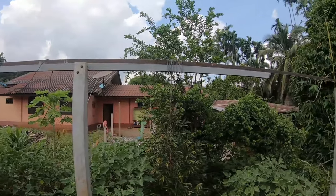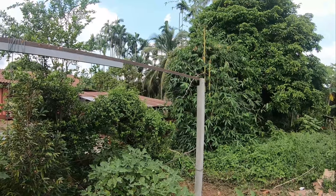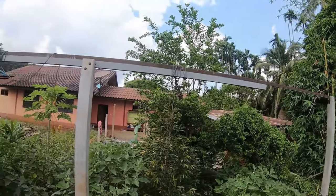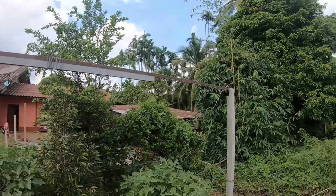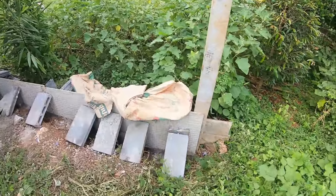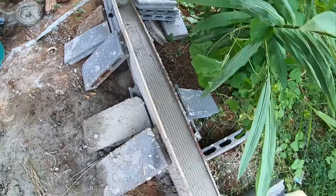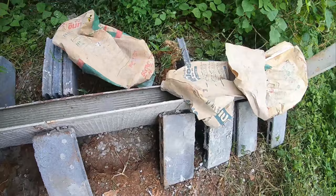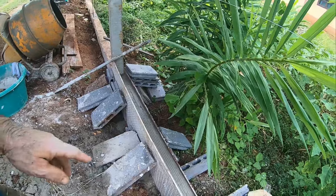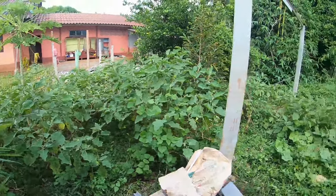The height of the steel — that looks perfect. There is a two-inch drop on that steel but that's just gravity, that's just the length of the steel pulling down on it. Once that goes up two inches, the top of that steel will be in line with the top of the post. So all that's left to do today is, once that's cured a bit, take the shuttering off both sides. If I leave it overnight it's going to stick to the concrete and I'm probably not going to get it off, and I'll lose two or three meter lengths of fascia which I don't really want to do.